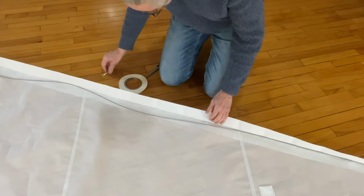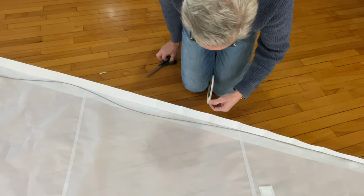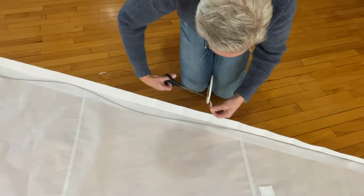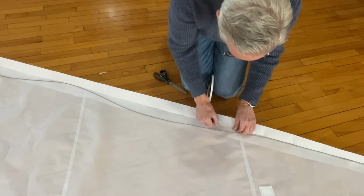This stainless steel wire, also known as a bolt rope, will prevent the overstretching of the luff of the sail, and when properly tensioned, it will eliminate sagging between jib hanks or snaps.